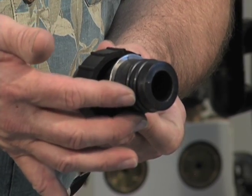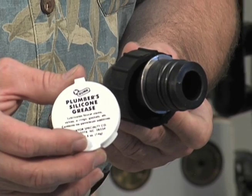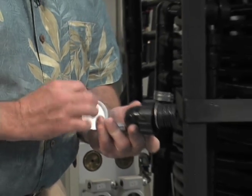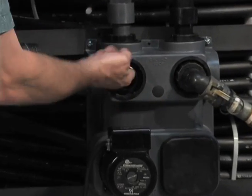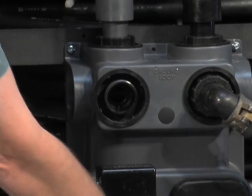An important component is that you should use a non-petroleum based grease. Take a light coating of this non-petroleum based grease and wipe the inside of all your connection ports. That would include all your piping connections as well.